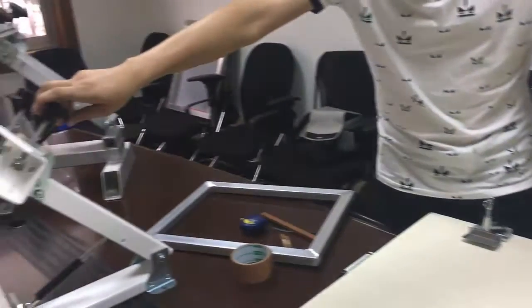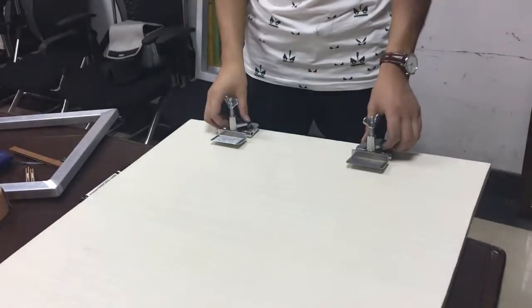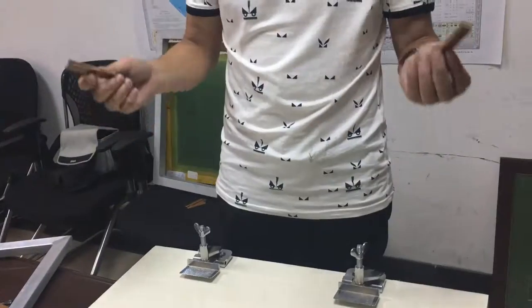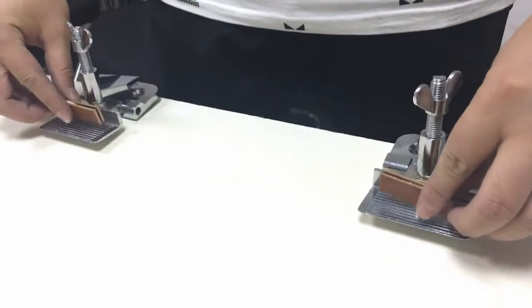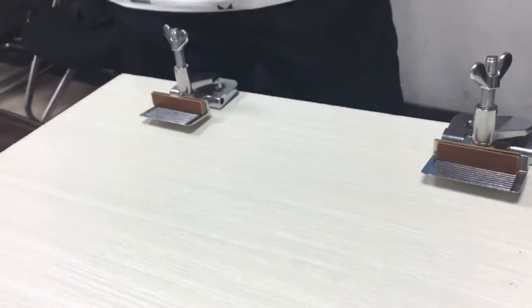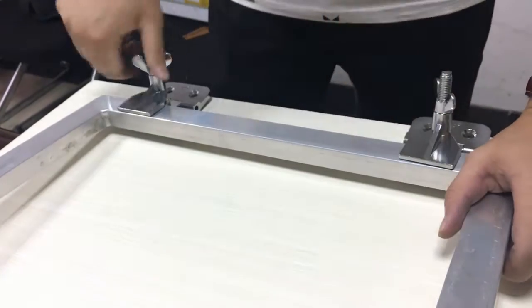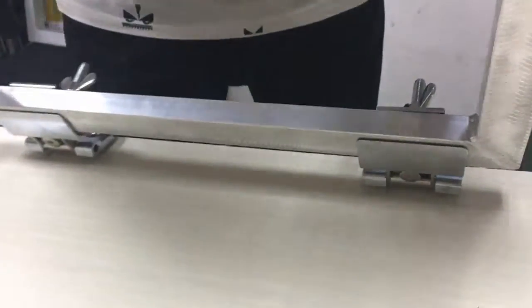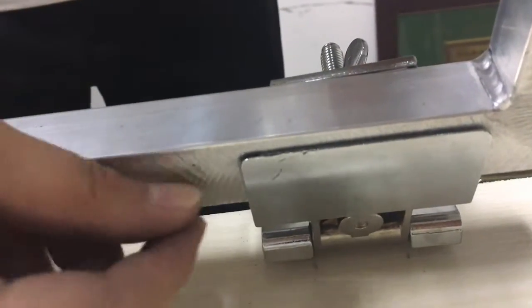But sometimes we know that the clamps or the printing press are stable and not changed very frequently. So another way we use is to put some spacers like this one onto the clamp. You need to make sure that the thickness of the spacers are the same. With the spacers in place, the clamp edge will not come out — it will stay inside of the frames. This also solves the problem.